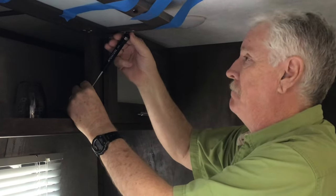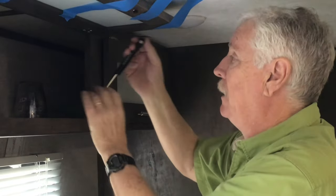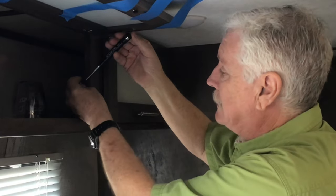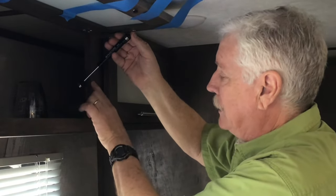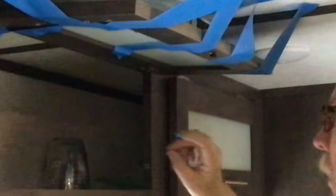You'd think the simple thing is to just install everything wherever it seems right - if I put it like this, that's where it would open to. That's exactly right, except there are some tiny things to consider. For example, this must be recessed back about a half inch behind this part here in order for it to have a place to go when you close it. There are two rules when it comes to cabinetry - my dad was a cabinet maker. Number one: before you drive a nail or put in a screw, you must pre-drill the hole.